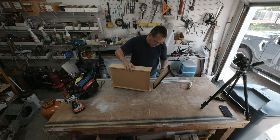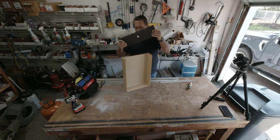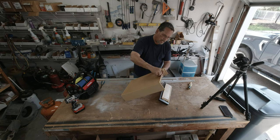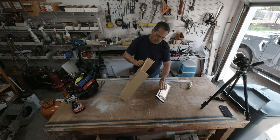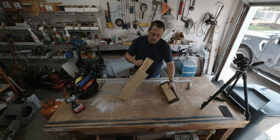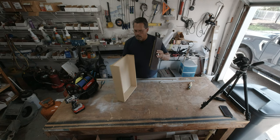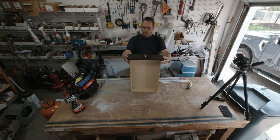I'm gonna go ahead and fit this drawer. All this wood meat right here came off the bottom of the front panel for the drawer itself. When I put this together, that's all going to line up and seam back together. We're gonna use wood glue — carpenter's glue — to put all this back together. So go ahead and line this up, making sure we don't have anything in the way to cause us to not get good adherence with that wood glue.